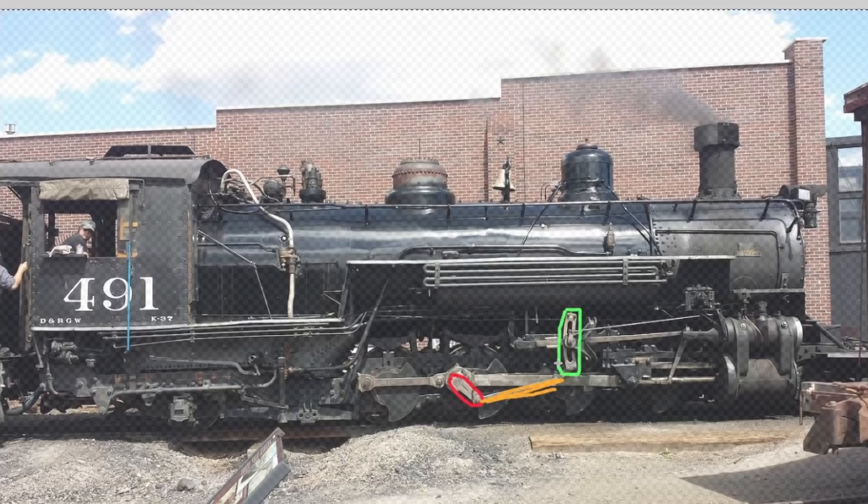The expansion link is the star of the show for this kind of valve gear — the Walschaerts valve gear. It pivots in the middle, so when the top moves right, the bottom moves left. We have the radius rod, and the Johnson bar in the cab — when you push it forward, it pushes the radius rod down; when you pull it back, it pushes it up. When pushed down you are below the pivot, so the rods move in conjunction with the crank. In reverse, it's on the opposite side of the pivot and moves opposite — this is how you pick forwards or reverse.